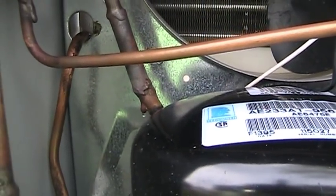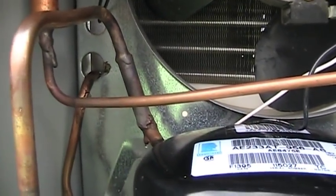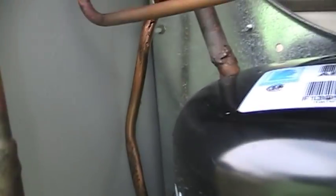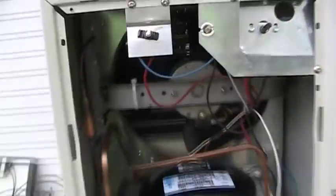I started to burn through the tubing on the compressor, and I was really making a pig's breakfast of it, and I thought I'd probably ruined the whole thing. But then my instructor said, no sweat — just get yourself a bigger piece of pipe that goes over the circumference of the original, braze that on there, it should go right in, and it did. I actually had another classmate help me with that, because he was interested in working on it too. Then we came off of here, I did this bend, did another bend, and that wiggly piece of tubing back there is actually factory original — it looks terrible, but that's what they did. Some of the joints look better than others, and to be perfectly honest, my torch was probably set a little bit cold at the time, but everything's all wired up and ready to go, and it definitely does work.